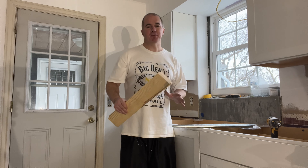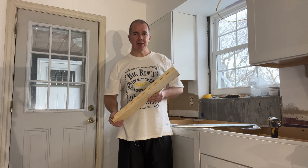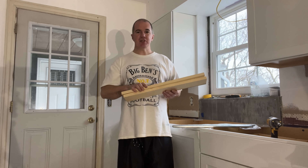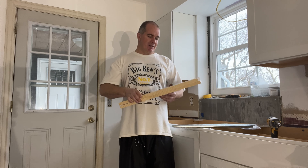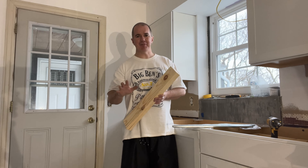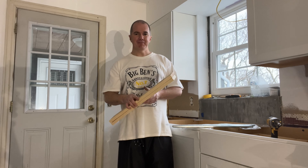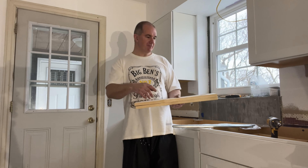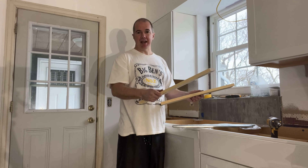To keep this as simple as possible, most of you probably don't have a table saw. If you do, I'll save you some money. We need these to be 22 inches long and three and a half inches high. Go to Lowe's and get a rough-cut construction-grade one-by-twelve-by-eight. You can rip it down with your table saw and get three widths per board — that gives you four lengths of 22 inches each, so 12 total, which covers six cabinets.